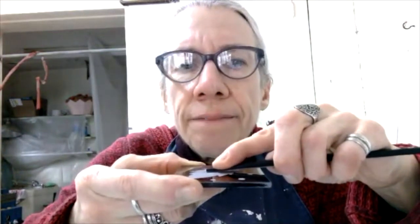And that is filing. Did I explain the hand position? Because that's the whole reason I wanted to make this video. So if I did, I don't remember, and I'm gonna show you again. Here's a piece of glass, right? You want your hand on the file like that. You don't wanna hold it like that. You don't wanna hold it like that. You certainly don't wanna hold it like this. You want your finger right towards the tip. Maybe not all the way over it, but right there, not there. That's too far back. This will snap right off.